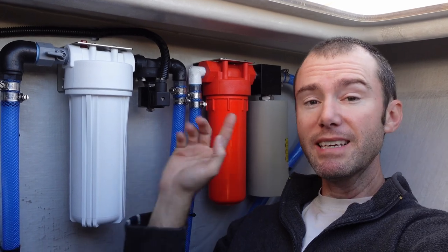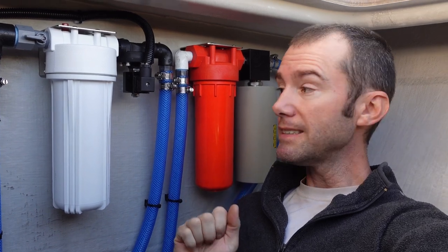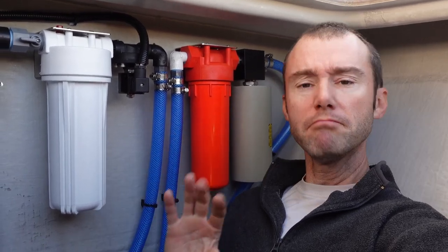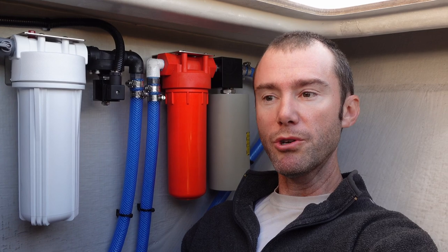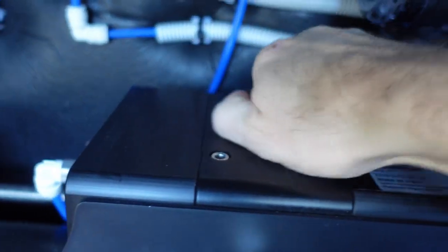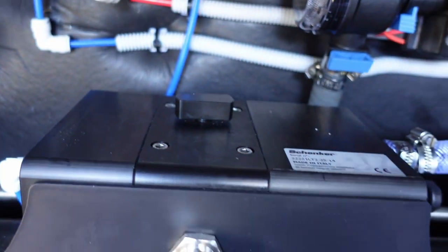So I gotta figure out why that's not working. I have attempted these connections again. I did some more Teflon tape, we did some pipe dope, and hopefully that's gonna be good for this. The pipe dope I used is potable water rated, so no worries on that front. I have attempted something on the 12 volt solenoid wiring, moved the ground to a different place. Maybe that'll work, but I'm guessing we'll probably have to do some more troubleshooting on that. But for now, let's do startup attempt number 2. I'll make sure to remember to open the pressurization valve a few turns. All right, babe, go ahead.